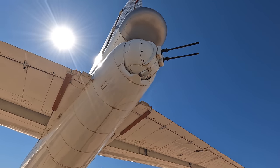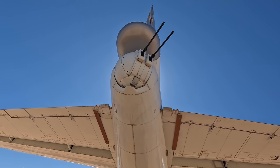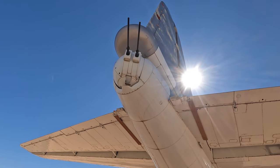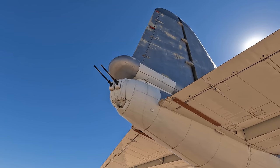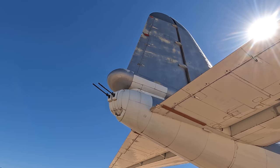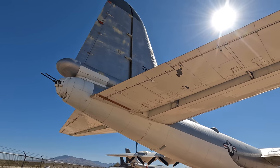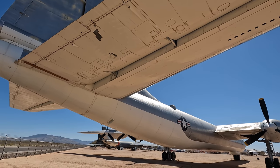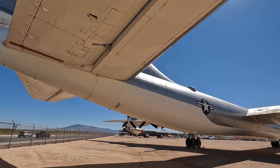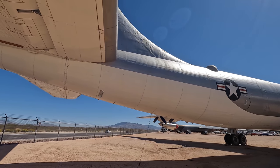Everything on this aircraft is massive. In fact, the control surfaces such as the rudder and elevators had the same combined surface area as the B-24 Liberator's entire wings — but they did not have hydraulic support to move them. Instead, the pilot only moved smaller servo tabs, which worked like trim tabs in the opposite direction, and the air would then move the whole control surface in the desired direction. It's quite an ingenious design, as it avoided the need for heavy hydraulic systems.